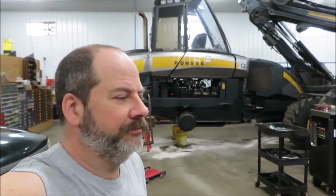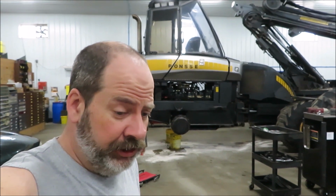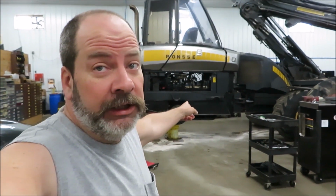One more thing I'll add to that is, I ain't picking on any customers, okay? But to you guys out there in the world that run these machines, I know it's a royal pain in the ass to tip the cab and pull the dipstick on them. And some of these didn't have the dipstick in them. Anyways, it's a royal pain in the ass. But when I got the text from Troy yesterday when I was up north, they said, "Hey Mike, there was only a quart of oil in the diff."